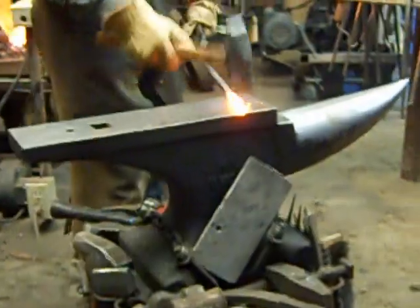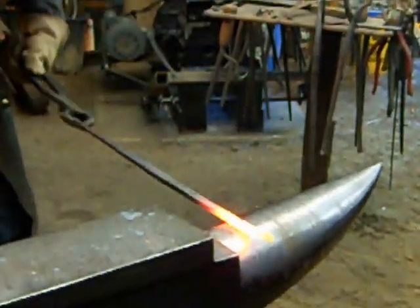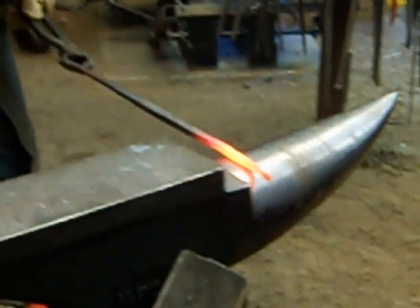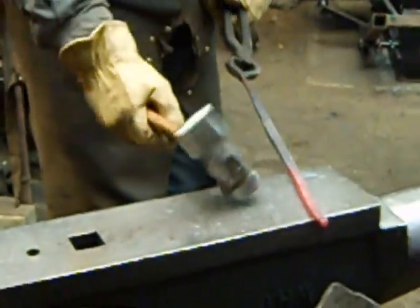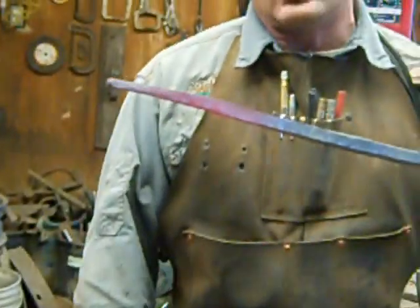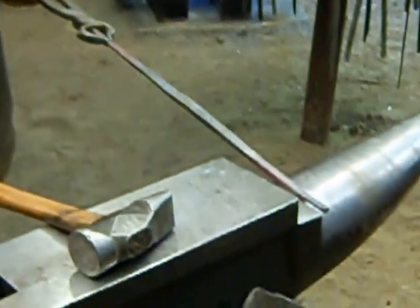Most of us try to draw out metal like this on the face - I've been guilty of it. However, by working on the horn of the anvil, it acts like a fuller. Then we can come back and straighten up when we get to a red heat and when we get down to the diameter that we want. I'll need to take another heat and square that up - it's not exactly square - but I've moved that metal a lot quicker than if we tried to draw out on the face of the anvil. Draw it out on the base of the horn and it'll move a lot faster.